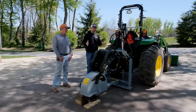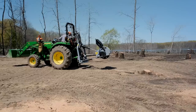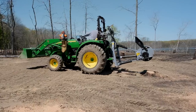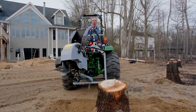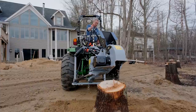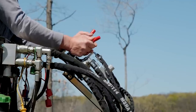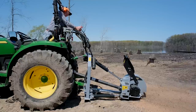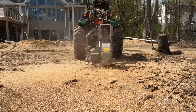The 3P24 is a stump grinder sized appropriately for the machine — 30 to 55 PTO horsepower is the range for this size. You have an optional hydraulic control so that you can feather and fine tune the swing both left to right and up and down. There's a flow control dial along with two individual handles to control the different operations. It has a very substantial frame accommodating both category one and category two three-point hitch, and a standard 540 RPM rear PTO connection.